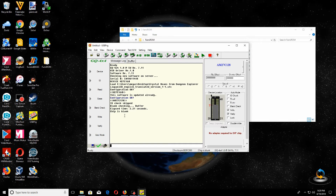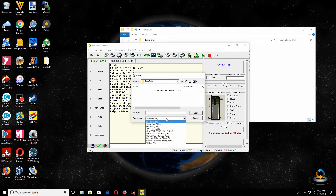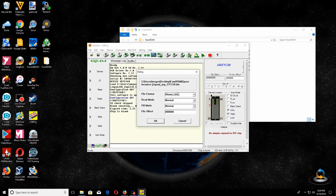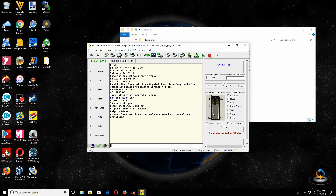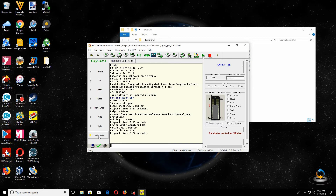Now that we chose the device, we're going to choose the file. We go here to Open, then go to FamiROM. I always do the PRG first, then the CHR. So I double-click on the PRG — 27C128. It says bin. Click OK. The file is ready and the device is ready. Now I'm going to click Auto Mode, which is going to write and then verify afterwards to make sure the chip wrote correctly. Just click Auto Mode and let it record. Pretty quick, considering the size of the ROM. And that's it — it verified.